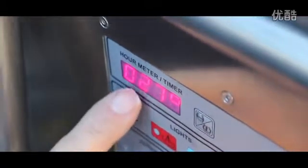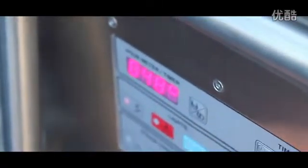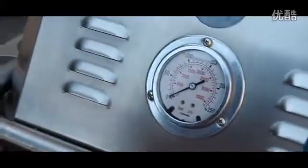So we turn it off then back on. You'll also see on the gauge here the temperature — so it's 27 degrees, 31 — it goes up very, very fast. This will get to 160 to 165 degrees. Now we'll take the other hose and connect it into the pressure washer — fit it in nicely and firm, not over tight. That's connected up, and now we just need to wait a few minutes for the machine to heat up.